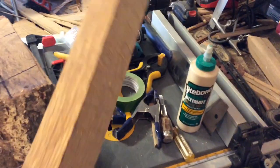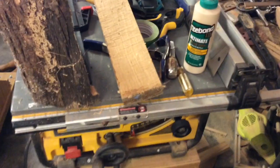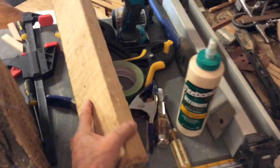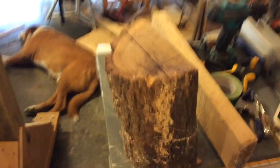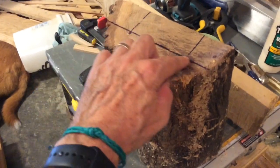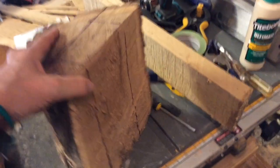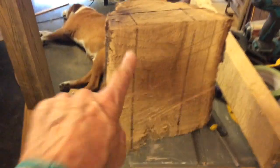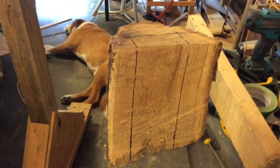So I'm looking for a piece of oak, and I still have various pieces that I cut out of the tree. This one would look like a 2-by-4 and is actually even bigger than standard dimensional lumber, but the sad fact is it's about three and three-quarters wide and only about an inch and a half thick. I still have this chunk of wood cut from the tree some time ago. I've already measured it out — I went about two and a quarter inches deep and about four and a quarter wide, with about ten inches along the length — so I know I have enough to get my 9 inches.